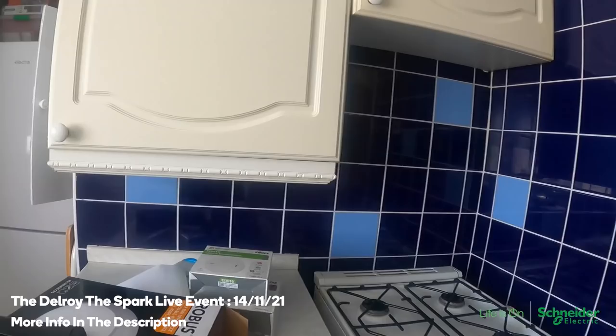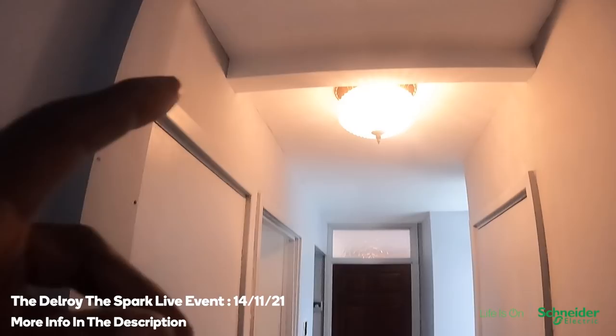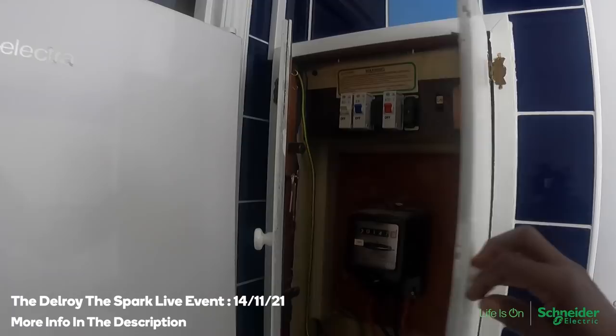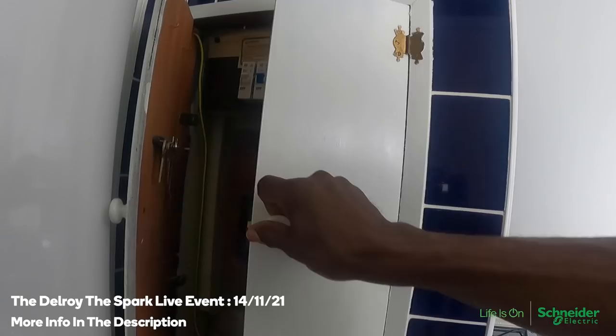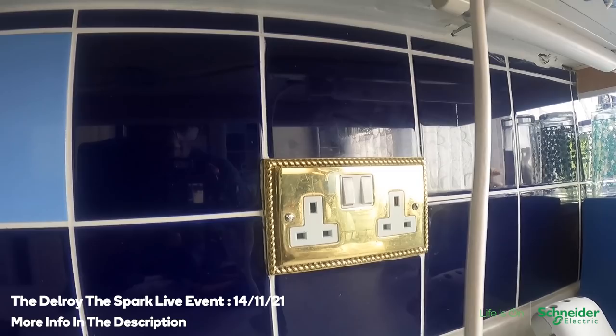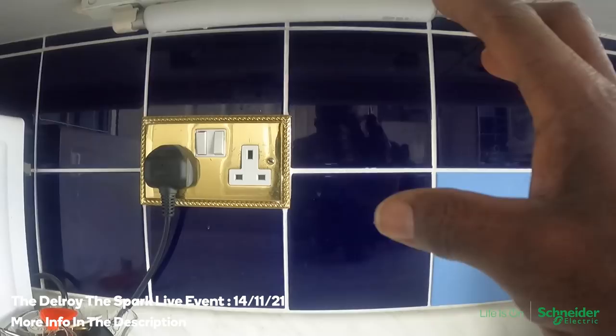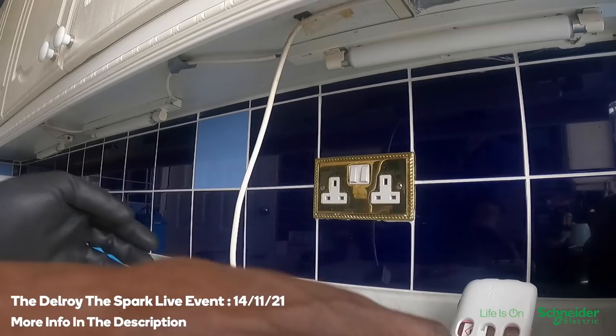To start with, I've got to get a cooker circuit in — going to put an electric cooker there. They want a heat detector in here, but those are the fittings on the ceiling I need to watch out for. And there was one in the hallway. I was hoping to pick up from a lighting point, but that's the type of fitting they've got here, so that's the big problem. That's the mantel unit I've seen. They made up their own door, so you'll need to get a metal one. This socket was disconnected last time — it's not connected. So it's either finding a box and putting a socket there, getting the wires properly, or blanking it off. But she doesn't want the tiles damaged, so I suggested we put another double next to this. She's agreed with that.